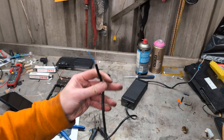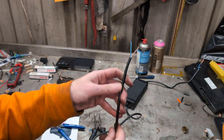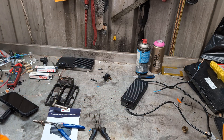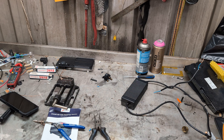Even if you're using it in the house and you've got RCDs, RCBOs, or everything is fused — for the cost of a plug, like a pound, it's worth it. You don't want a 13-amp fuse — 13 is too much. It's supposed to match your fuse to your current draw. A 3-amp fuse would probably be absolutely fine.